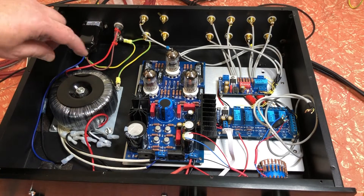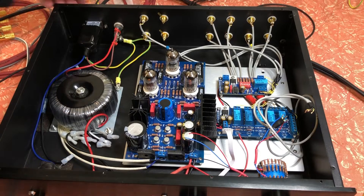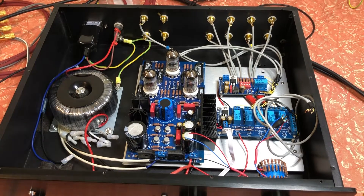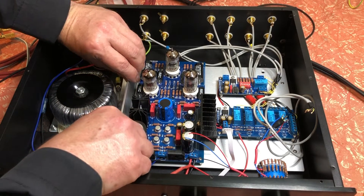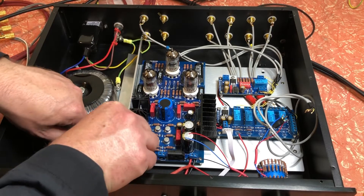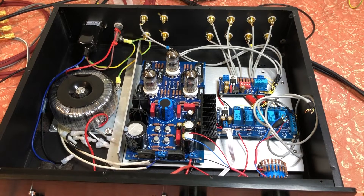What I did is rotate the power transformer 90 degrees to get the tails out of the way so I have a little bit more room to work with. I want to show you something — I'll pull the mains out. I've got this aluminium channel here, and if I just pop this in here going in this way and put the power back on — the hum is much reduced. It's basically the same on both channels now, which indicates to me that that is the problem.